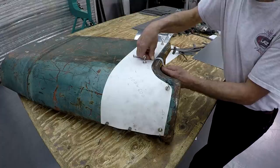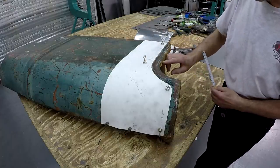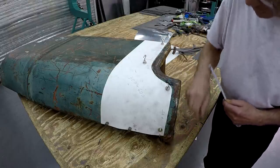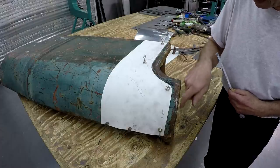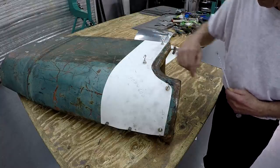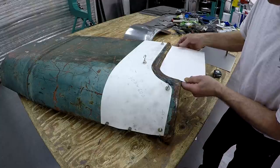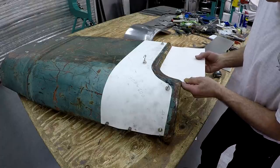I'm going to use metric here — it's about 54 millimeters on the first part, which is a little more than two inches. This flange is a little lower, so here I'm using 45 millimeters. And I cut out another paper that fits inside here so I can see the inside radius — I can use that as a mark when I cut this out in metal.